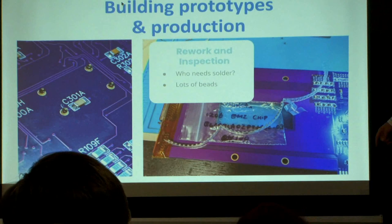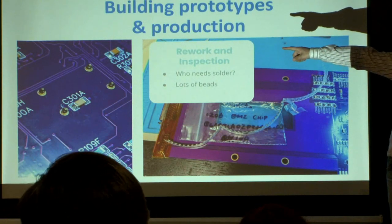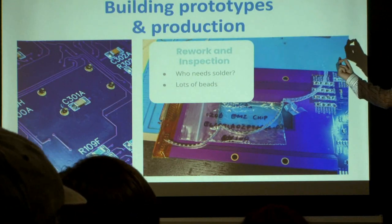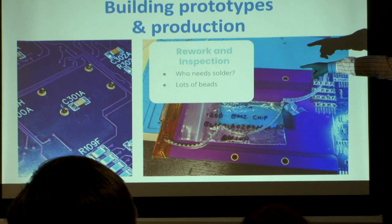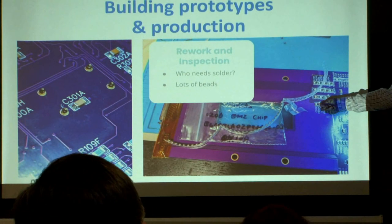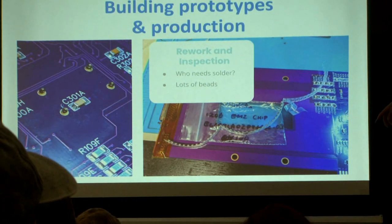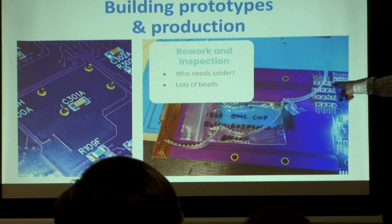Another really cool thing: the GALs on the original card I got were all protected. What if they changed stuff and it's not in the Haney files — how would we know? We can't read them, and there are PALCEs, so other reverse engineering options didn't work with this one. So Chris decided to build a brute force PAL decoder which analyzes — it doesn't only decode PALs, you can put any logic chips in there and it'll basically tell you what's in there. It's quite nifty — it needs a little more work for more complex stuff, but it was useful during the development process.